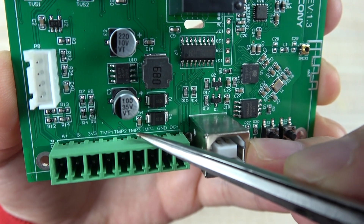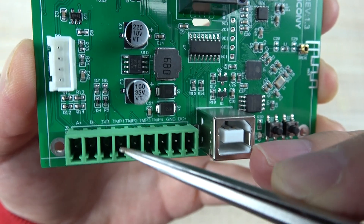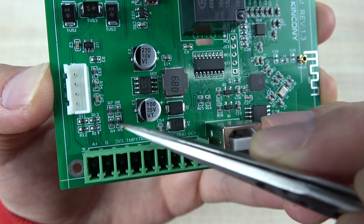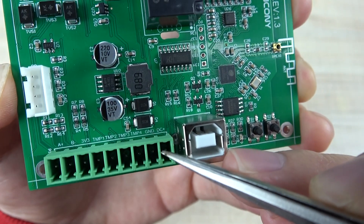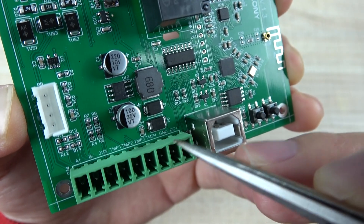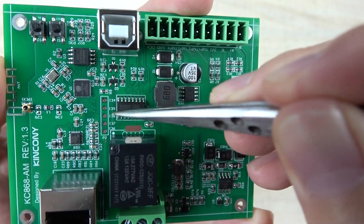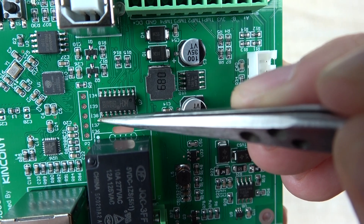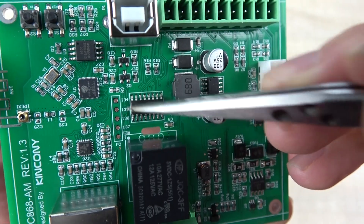You can see here that is RS485 A and B. That is a 3V power supply for your external sensor. That is GPIO1, GPIO2, GPIO3, GPIO4. These four GPIOs already have pull-up resistors, so you can connect your temperature sensor, humidity sensor, or other devices. And this is the DC power supply, supporting 9V to 24V. There are also some holes on the PCB — GPIO34, 39, 38, 37, and 36.